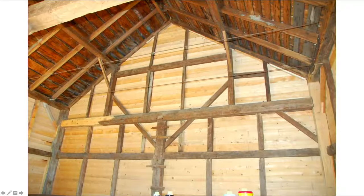This is the finished structure. We resided it. You can see off to the left the tie beam — I've got a wedged scarf. You can also see over in this corner some cleaner wood, which is what's referred to as a Dutchman repair, because that tenon and both the mortise were gone. I had to create a new pocket, and this attachment here actually projects into the mortise and then gets bolted to the brace — same thing on the other side. I put a new post on this side using a scarf — a half lap, basically a tenon into the mortise and the post.